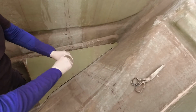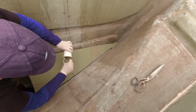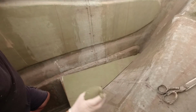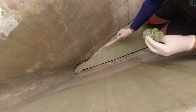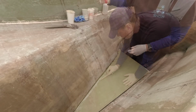The only thing is, right up in the bow there, there's a bit of a gap, about a centimeter, so I'm going to have to try to work out some way of blocking that in before I can glass that shut. It was never going to be an easy fit. It was just simply that complexity of where the foam are meeting on both of the sides of the bow as it goes forward. But for now, I'm going to fill this, get it totally full, so that when I tab it, there's no chance of any water sitting in the gap.